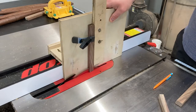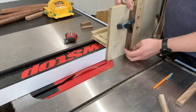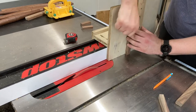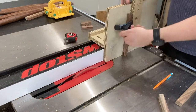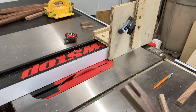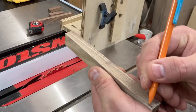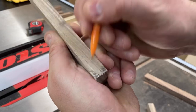And here's the bridle joint jig's maiden voyage. First, I'm cutting the mortises. For a bridle joint, you want your blade height to be exactly the same as the width of the piece that you're cutting. And with the mortise cut, I now try to size the tenon to match, being as conservative as possible so that I don't mess it up.